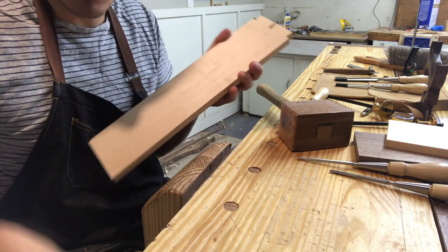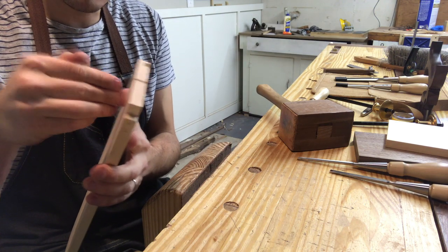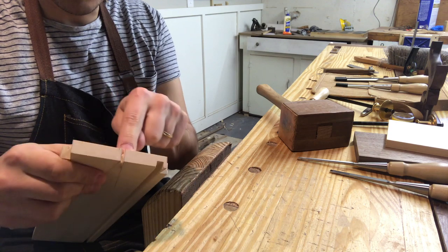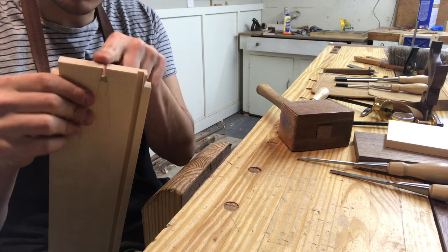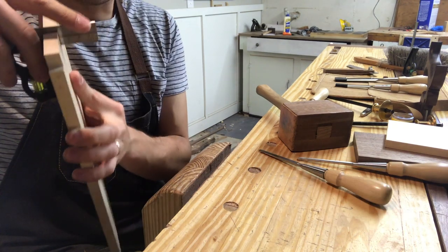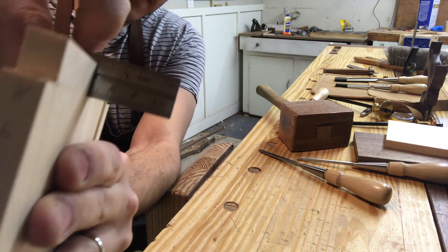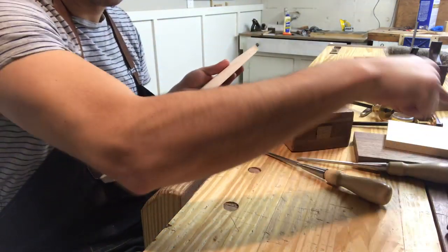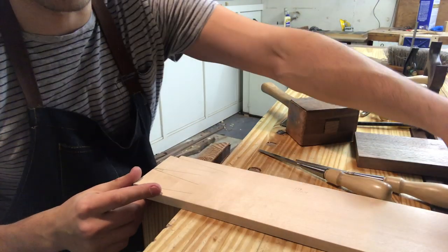Anyways, that's your job. That's the most important thing about this middle pin, is to get it perfect across that way. And then all three of these sides on that triangle have to be perfectly square. Across, and then across this way, and then across this way. I just did a little bit more work, that was easy, and it's sitting all the way across, which is great. Other board now, and once I finish this board, we're gonna transfer our tails to the actual drawer front.